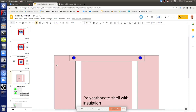The rebar thing could kind of do it, like the top of the rebar. We'd still probably have to weld angle on top to get a clean edge to put the top cover on. Otherwise, it's all leaks. I mean, the rebar is not accurate enough. It's bumped. So assuming this is a welded rebar structure, which we can do really quickly by doing a six-sided cube method, which means you're building one side at a time, I want to still put an angle on top here so that you can lay your polycarbonate cover on it.